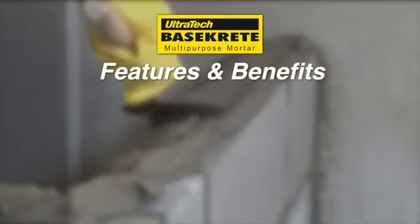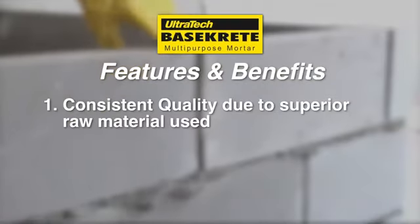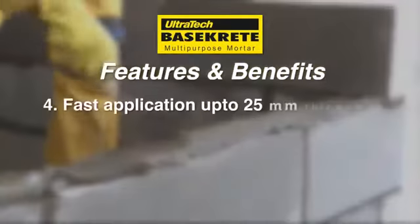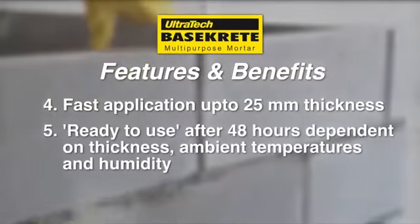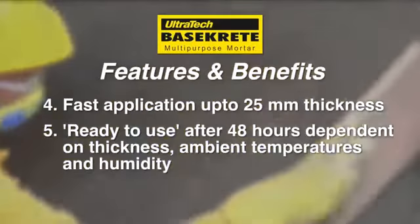Features and benefits. Consistent quality due to superior raw material used. Excellent adhesion and compressive strength. Optimum pot life. Fast application up to 25 mm thickness. Ready to use after 48 hours, dependent on thickness, ambient temperatures and humidity.